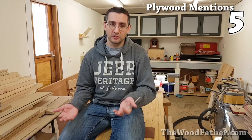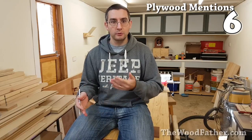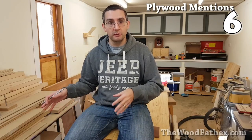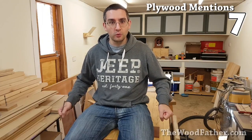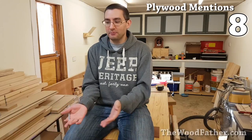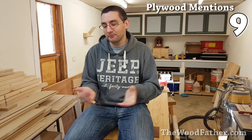I worked out the pine would cost about $130 to $140. Not a crazy amount, but why spend it if I've got a sheet of plywood that would do the exact same job. Before starting the project I had some pine offcuts — the same sort of wood I would have bought — and I cut them into strips the same as some strips of plywood. It wasn't a very scientific test, but I just put my weight on both of them to see which one gave the most, and the plywood was stronger in every scenario. Plywood is basically just sheets of wood oriented different ways with lots of glue sandwiching it all together, so I think it's going to be more than strong enough.